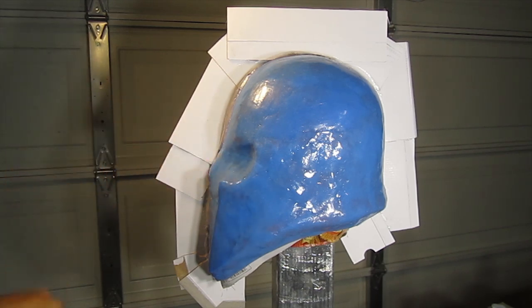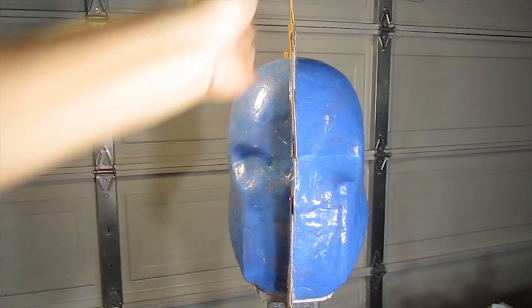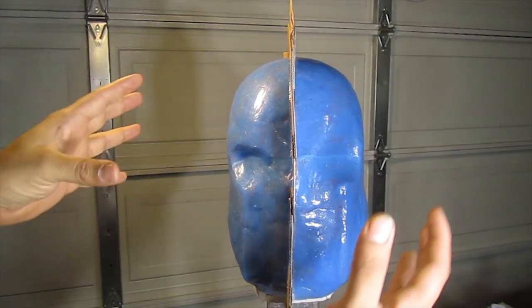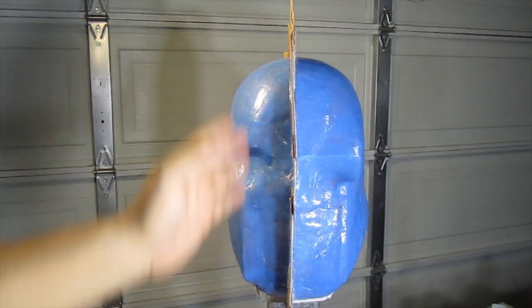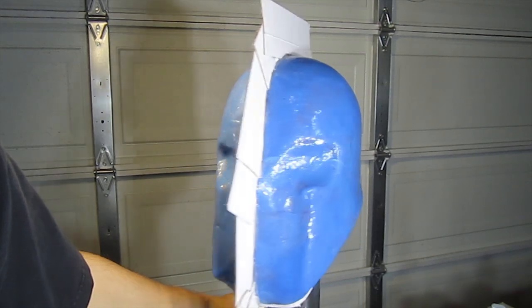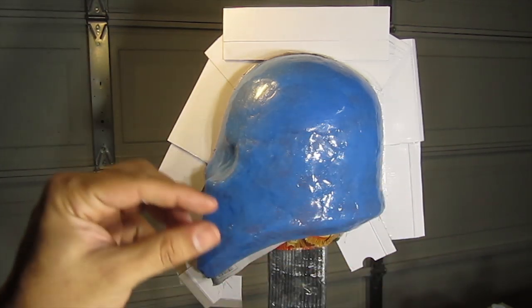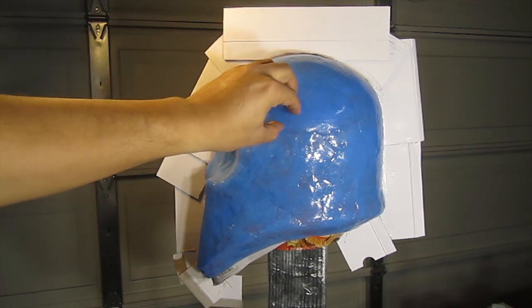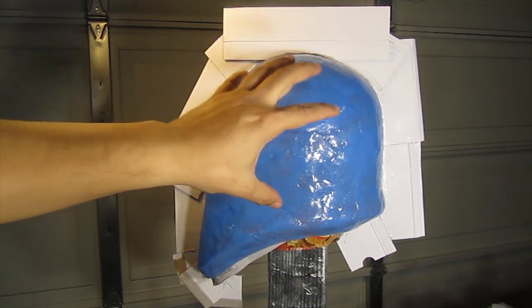So right now, this is what it looks like. It'll be a mother mold, the half shell here and the other half there, so it would come together. So we're gonna do one set at a time. Now that we have our mohawk or shadow frame on here, what we're gonna do next is grab the wooden dowel lugs that we cut out and fiberglass, put a little bit of silicone here and there and embed them on there, and create our keys or registration marks for our mother mold shell.